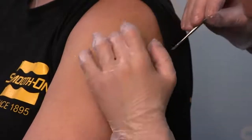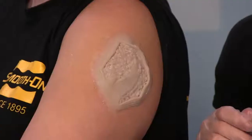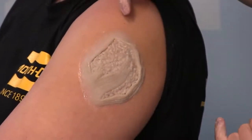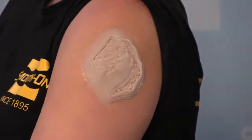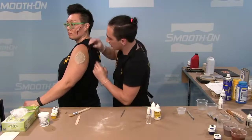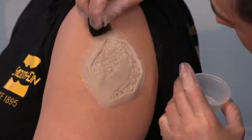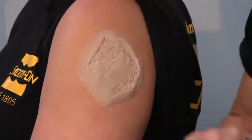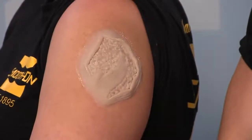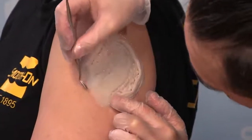So there we go. And then one other thing you can do, an option for it, can you just go back to this really quick, Alex? Thank you. So you can see that we have those nice fine edges, so they go in really well. We do have some spots that are sticking up. So we're actually going to take, again, that sponge that we had earlier, and just take a little bit of this and go over that edge. And this will help, one, get those edges back down, as well as what Jason was asking about, adding some texture in. Actually, I see a piece right here that kind of flipped. But we need a little bit going on underneath there. So just get underneath there, roll it back down.